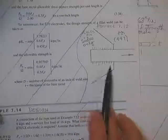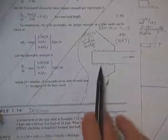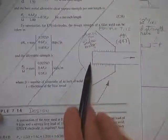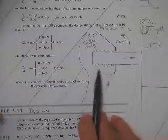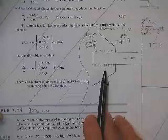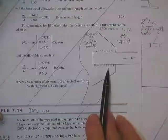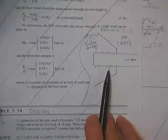You got 1, 1, 1 if you had end welds, and you were willing to live with 1, 1, 1. But if you wanted to, you could take this one times 1.5. But then these had to be cut down by how much? 15% down. That was a 0.85. That's correct. Take your choice, and you got the larger of the two, which is an unusual gift, but true. That doesn't apply to us. We don't have an end weld.